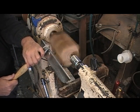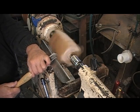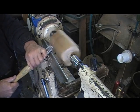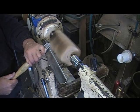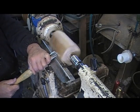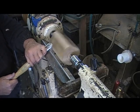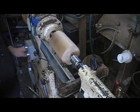Speed on the lathe is about 650 RPM. I am between centers, have it locked down — roughing gouge. All I'm looking to do is remove some of these big corners, because those big corners will tend to throw it off balance. I don't want you to be scared of this when you turn it.